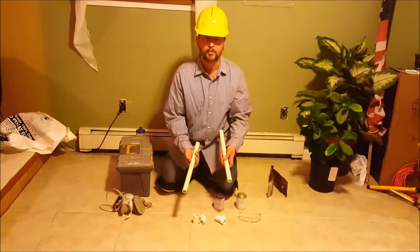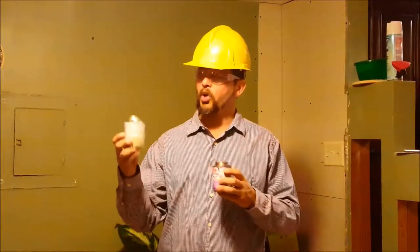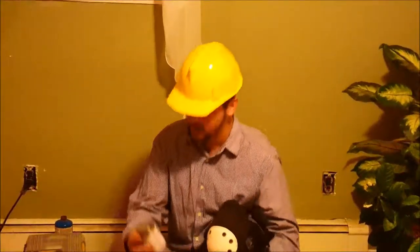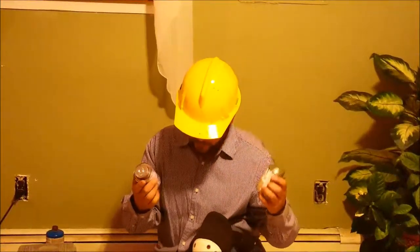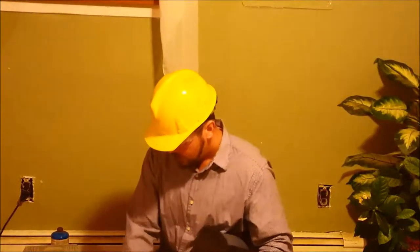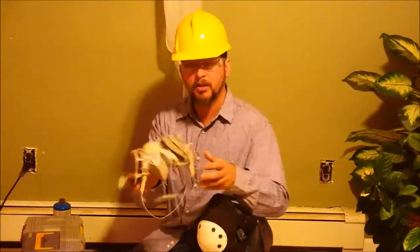So it's gonna be quite simple. I always remember when using the clear PVC cement and purple primer, you may want to open up some windows and get some ventilation, because these things will rock your socks. Take a few breaths of these and your head will start spinning quickly. Anytime you're using a poisonous substance such as primer or PVC cement, you may want to put your glasses on — I strongly recommend it. Very very important. If you're a little queasy, you might want to put a mask on.